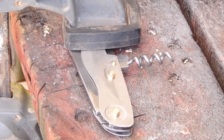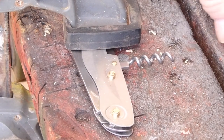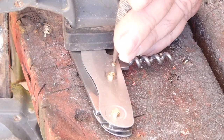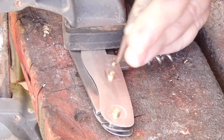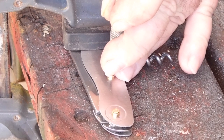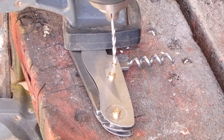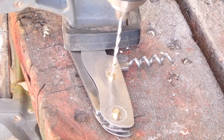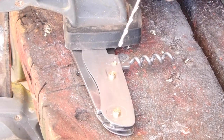I'm trying something different this time. I filed a little flat spot on the back tools so I can get my punch in. Previously I just filed it off with a file. I can see there's a definite difference in size between the pins. I'll need to make sure I keep the collars separate — 2.5mm and 3mm. A press drill would be handy, but I don't own one. Slow and steady gets the job done though.